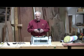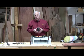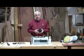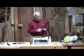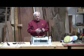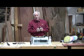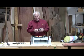The honing guide made by Wood Artistry is a stand-alone honing guide that can be used on water stones or abrasive paper, as well as with the Lap Sharp. It has a series of numbers on the side for setting the angle, and it just clicks into place. You can snap the angle so that you can move it from angle to angle.